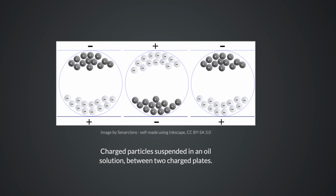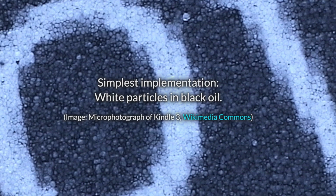The slow refresh rate, because it's an analog display basically. It's these little particles sloshing around in this oil. They can only move so fast physically. So this is an early version of an animation mode I was working on. You can see this is my nice clean black circle, which is becoming a blobby, smeary mess here, and it's leaving this kind of slime trail. That's because the voltage isn't being held for long enough to actually totally flip those pixels over to white. It's like the little particles are stuck in between the plates, right?